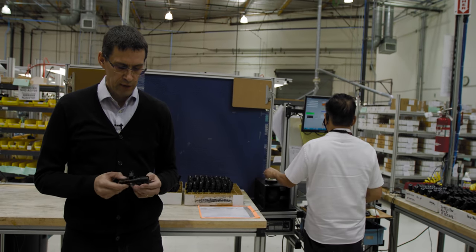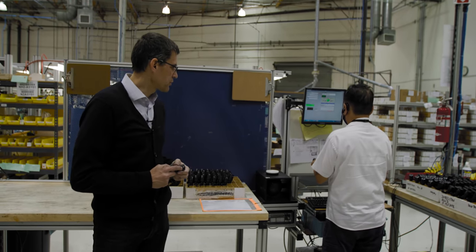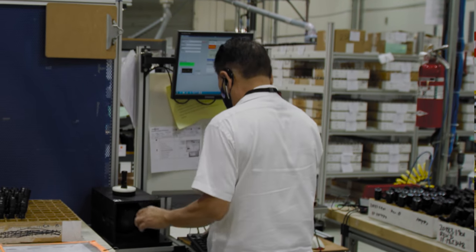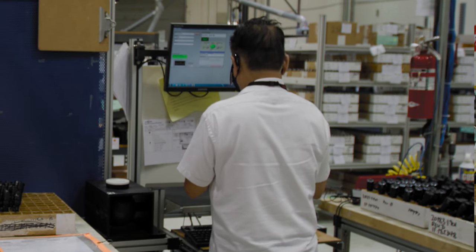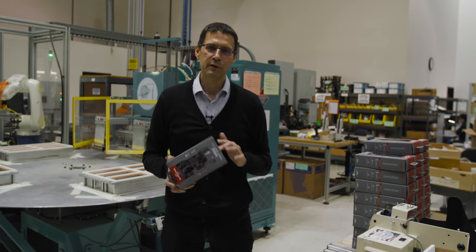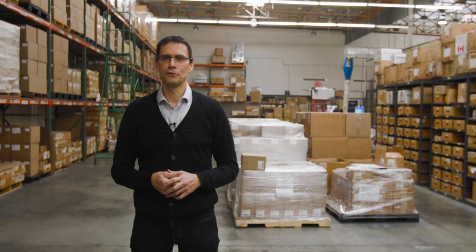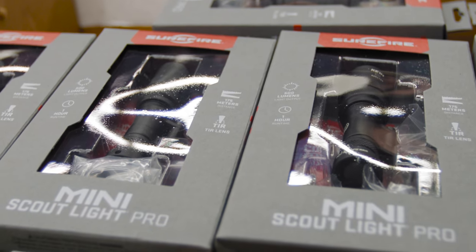In the final step, we have the head assembly with the barcode from the engraving process, and we measure the lumen output. The operator combines the work order with the serial number, puts it in a sphere, and we measure the lumen output — collecting all data to ensure consistent light output throughout the whole process. Then it moves to the final packaging operation: the light goes into boxes — assembly boxes, clam packs, poly bags, or craft boxes — and then to the shipping department. Lastly, we are in the finished warehouse where we house all final products and ship them around the world.